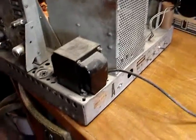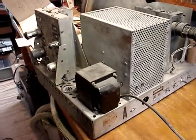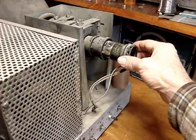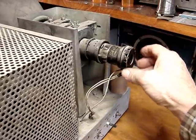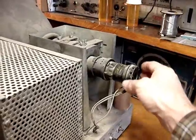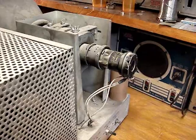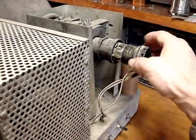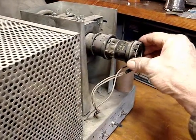Here I have the chassis for the 1948 Silvertone TV on the bench. One of the things I wanted to determine is if this CRT had bad connections. I couldn't light the filament up when I was at the man's home — the man who gave this set to me. So I assumed that either the tube is broken and went to air — I don't think that's the case — or the filament could be open, or maybe we just have bad pin connections.